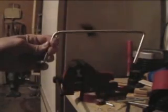So that's just a normal handrail. And if you cut it like that, you might want to file that down. So that's that. And if you're gonna do more kinked rails and stuff, basically just mark where you want each bend and then bend it in different directions. I will tell you that doing flat bars is a lot easier. Like with that flat bar I showed you before, I don't think I have any scrap to show you, but it's a lot easier because you don't have to line up all the bends. So let's see how it works.